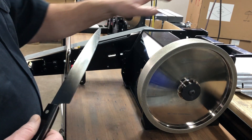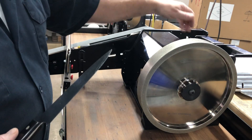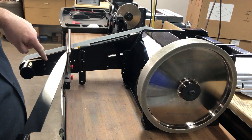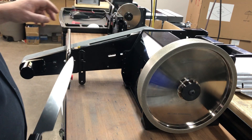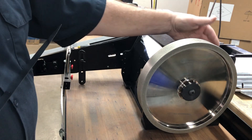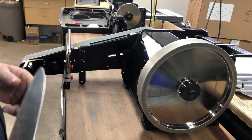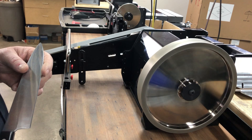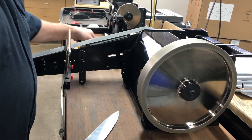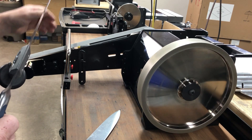The Edge is designed to be a workstation so it can mount many things — this is the basic grinder and you can put all these other things on it. It comes with several mounting points: wheel guard mounts in the back, quarter-28 tap tool mounts on the frame, so you can move things around whether you're grinding in the vertical or horizontal position, in front or in back of the machine. The Edge also has forward and reverse, and the really nice part is that it doesn't go very fast — if you want to slow down, it's just like moving a knife on a sharpening stone.